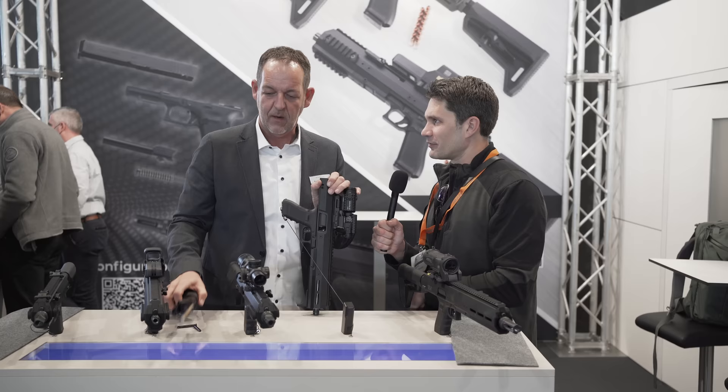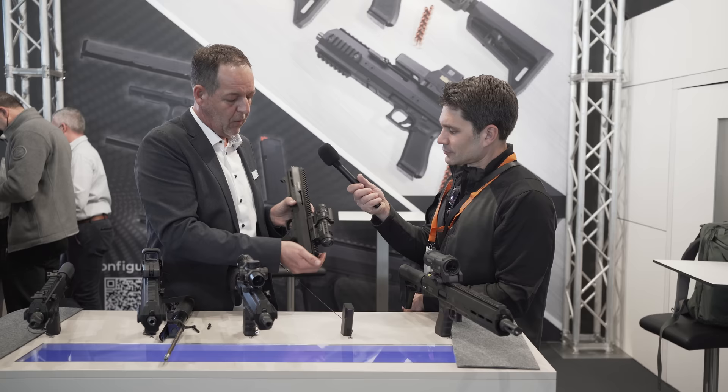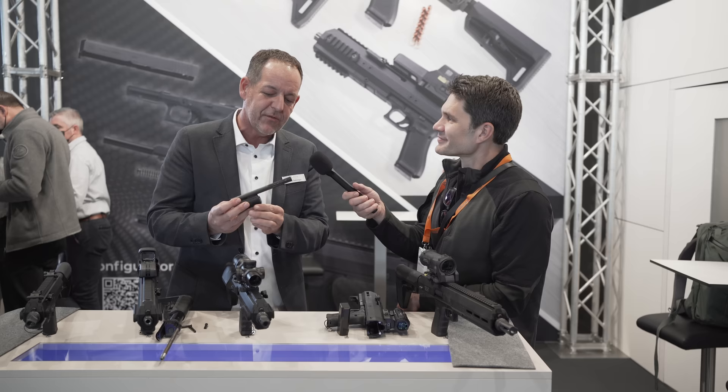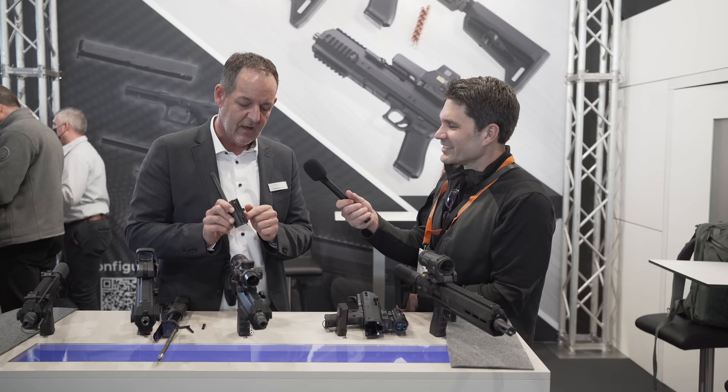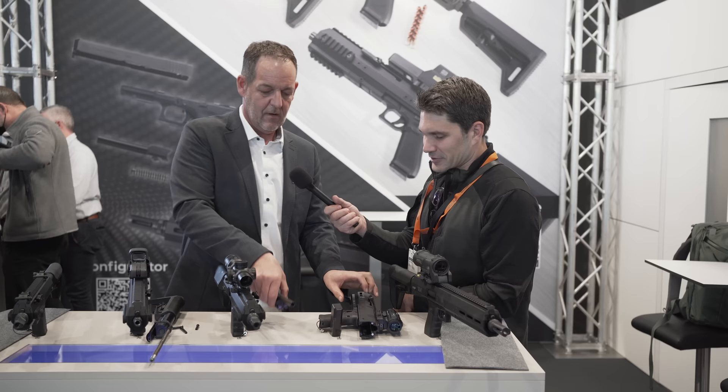There's a third bolt that fixes the frame in space, and you take out the bolt carrier, which may also look a little familiar from its shape. We use the original Glock striker, unmodified, but we have our own firing pin safety, extractor, and ejector. It's a blowback gun, so it's not very complicated.